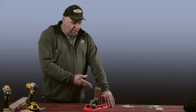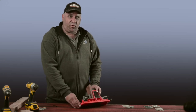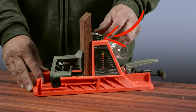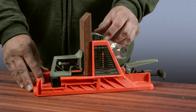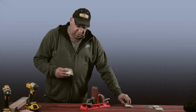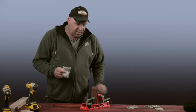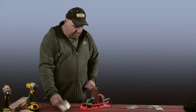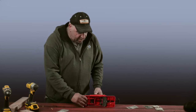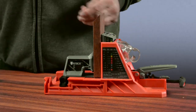With this particular size of wood, as indicated earlier, it needs a particular size screw. The indicator shows we need a screw of the yellowish color. We have a combination of different types — coarse screws and fine screws. Coarse screws are great for this project because we're going into softwood. So I've got these two yellow screws and I'll now load the driver bit into the impact driver.